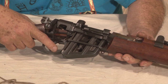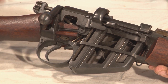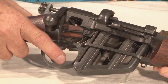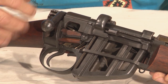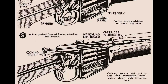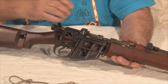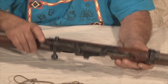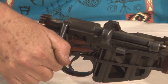When we pull the trigger — it's a military trigger, a two-stage trigger — as you pull the first stage back, the angle on the front of the sear, where the cocking piece sits on the sear, is at such an angle to make sure that you don't accidentally fire. It actually cams the cocking piece backwards first. Then you take the weight, and the sear slips down the front of the cocking piece and fires the rifle. With the safety engaged, it locks into the cocking piece and stops it from moving, and it also locks under a projection on the back of the bolt, stopping you from lifting the bolt.